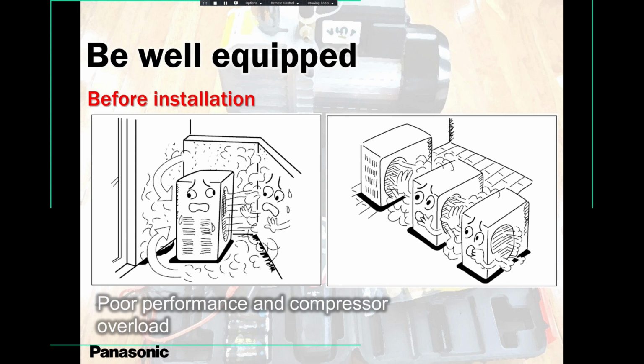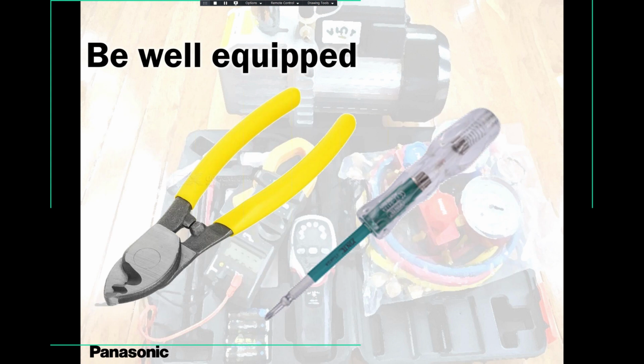Don't place outer units like that. If you have a big project, don't place the outer units like that. It's not good. You're dumping heat or cold air on each other, causing problems, causing it to give you an error as if the unit is low on refrigerant or has too much refrigerant, depending on which mode you are working in.